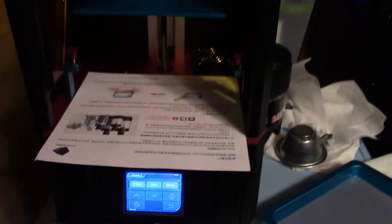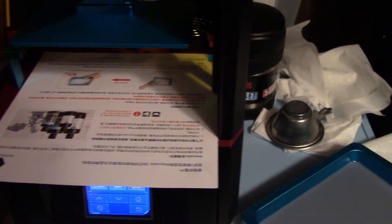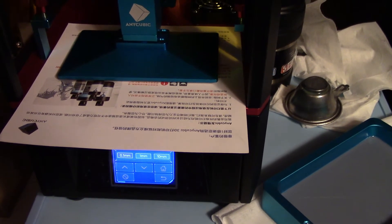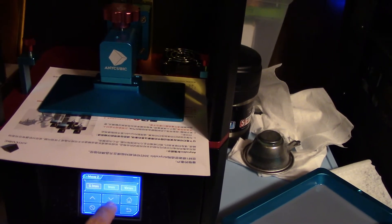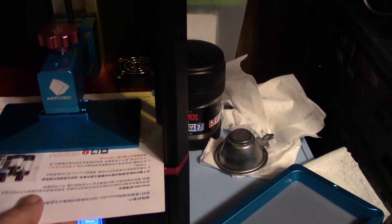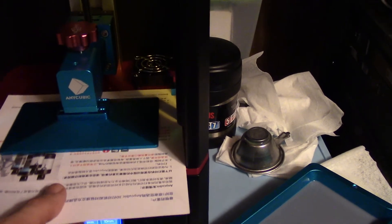I always like to go at least 10 or 100 millimeters up and re-hit the Home. That's tight. Set that back to 0.1. Again, hardly any resistance at first. One, two, three, four, five, six, seven. Feel a little bit of resistance, but not like I used to. That's eight — okay, that's where usually seven would be.